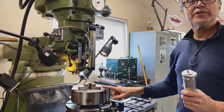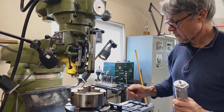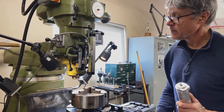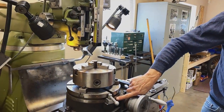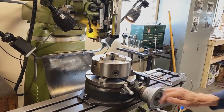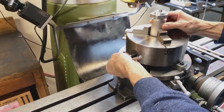What you're looking at is a rotary table. It's a chuck mounted on the rotary table here. When I turn this, it turns and I've got all of my degrees here and the minutes here, so I can be really, really accurate. I'm going to set this to zero now. That's my zero right there and that's how it's going to get mounted.